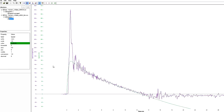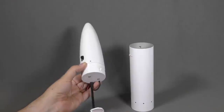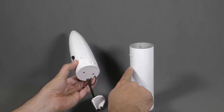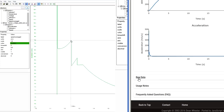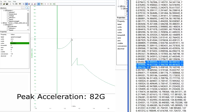So how fast did the rocket go? Comparing the real data to the simulated values, we can see that the predicted speed matches quite well with the actual readings in this part of the flight. Because the rocket went higher than predicted, the top speed would have been a little higher as well — we're going to say somewhere close to 165 metres per second, or 595 kilometres per hour. We're going to make a slight modification to the nose cone: plug the vent hole below the camera lens, drill a couple of larger holes in the base of the nose cone, and add vent holes in the side of the payload bay, to see how that affects the readings on the next flights. In terms of top acceleration, we'll derive that from the simulator data — the simulator says around 80G, so adding a little for the higher rocket performance, we're going to say it was around 82G for the second launch.